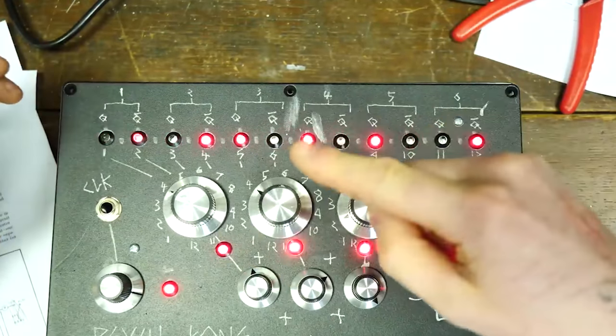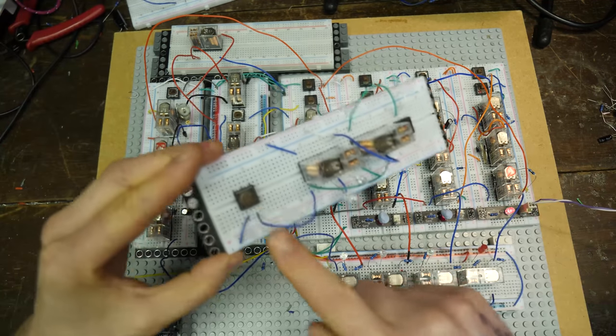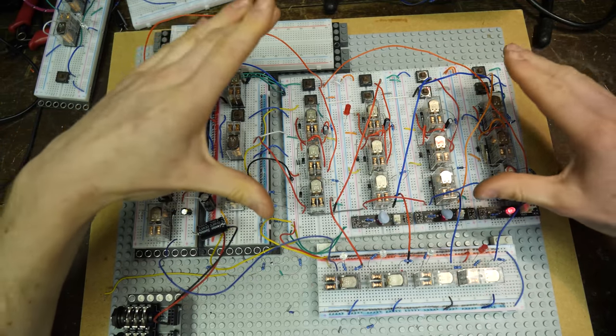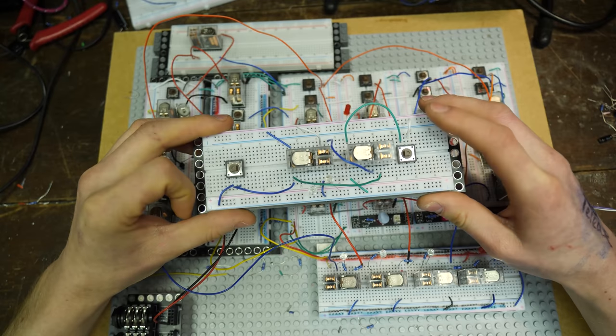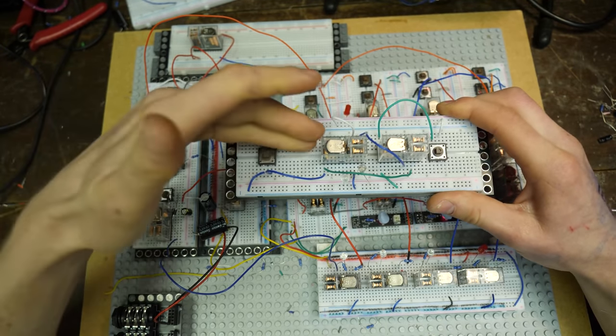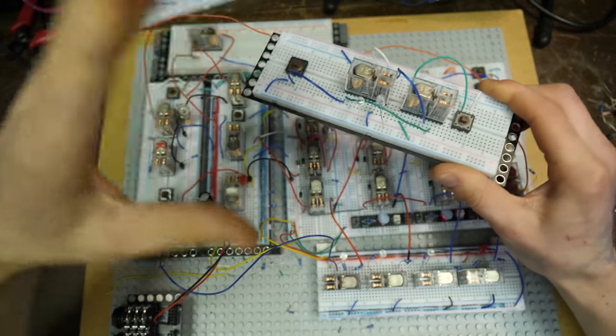And these are pretty much the fundamentals of step sequencers. They're like a posh version of the set and reset kind of latch thing. For building this sequencer, I required a D-type flip-flop. That means there's an input that isn't set and reset, but the set and reset are in the same input. Meaning if the voltage going into it is high, it sets it, and if the voltage going into it is low, it resets it.